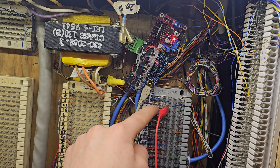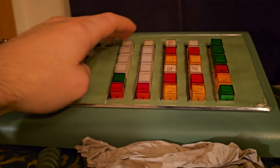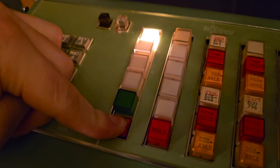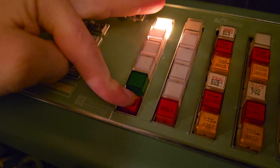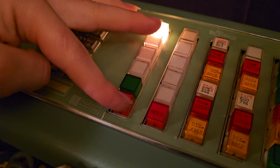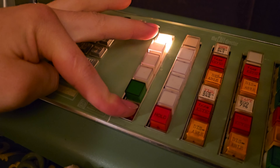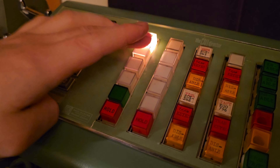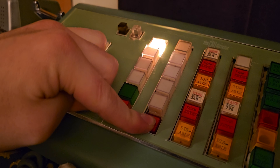Basically what this H bridge is doing is it receives a signal from the Arduino's pin 6, and this will tell it to turn on and off. I'm using two of the outputs from this H bridge, both of them common together to the normally open, and I just soldered wires directly underneath that go to both. The H bridge can be told to do either negative or positive, turning it on or off, and that has all worked just fine for my testing.